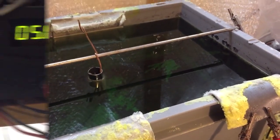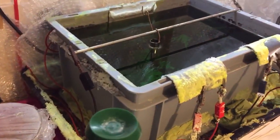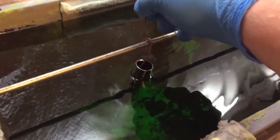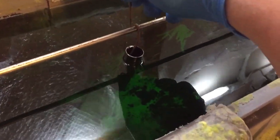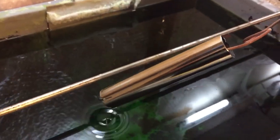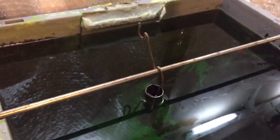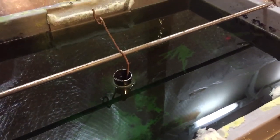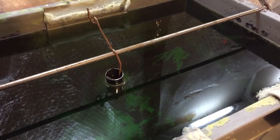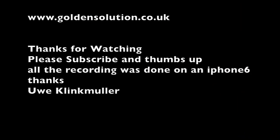After a minute or so I take it out. You can see the amp meter moving — 1.7 amps, that's fine. You can already see the difference — the top bit I didn't remove, so you can see a little chrome still left at the top. You can see where the border is from nickel to chrome. Normally I would put the whole item in, clean it, and then you can gold plate it if you want.